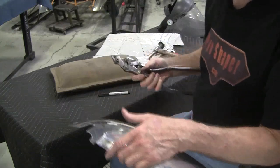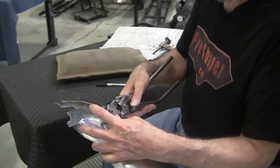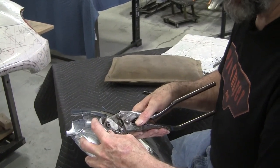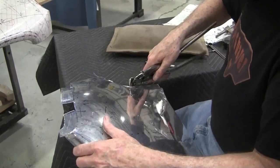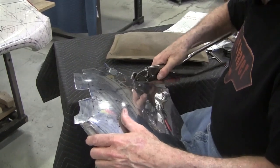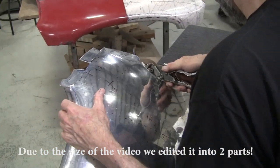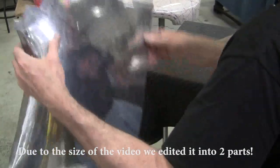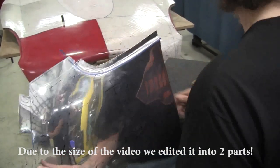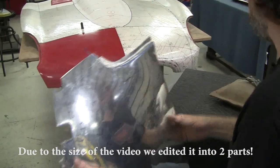These would normally have been about an inch and a half or inch and a quarter longer, but I just cut them off to about a three-eighths cutting edge. I wish I had done it at about five-eighths. What that allows you to do is nibble — so I can get in here and cut that right around. So I trim that little excess off. Now I'll sand that with 80 paper, and then I want to get a post dolly die and change this angle — I've got to drive this one down. So that's the next step.